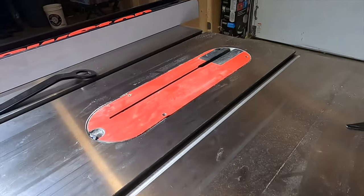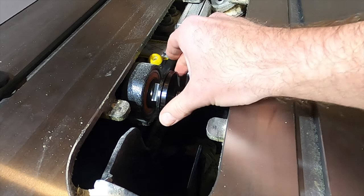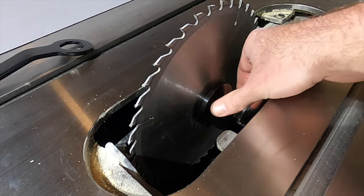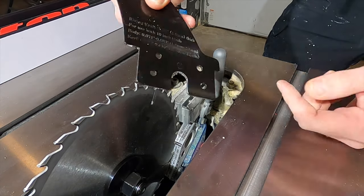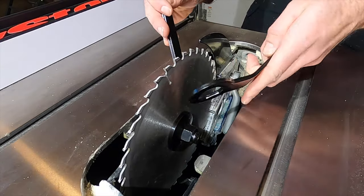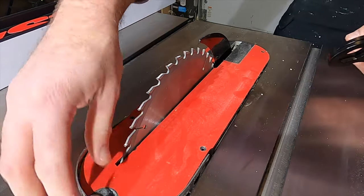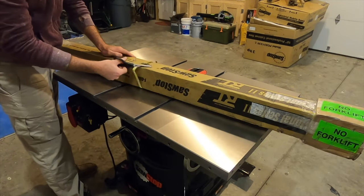Here's a better view of how you put the saw blade in. You lift the throat plate up, unscrew the nut holding the washer on the arbor, then the washer itself comes off so you can put the saw blade right down in. The blade slides onto the arbor, you put the washer back over top and then put the nut back on — really just like any other saw blade. The riving knife lines up with a couple of holes: pop the lever up, pop the riving knife in, snap the lever down and it's secure. Tighten the blade with a couple of standard wrenches — no need to over-tighten — then pop the throat plate back on and you're finished.